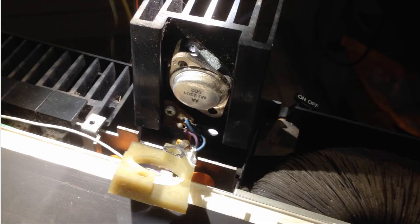Down here you see IC3, the biasing Darlington, which is also mounted against the heat sink. All the PNP Darlingtons — this here is the 2501 — these heat sinks have the corresponding biasing Darlington mounted against them to thermally stabilize the output.